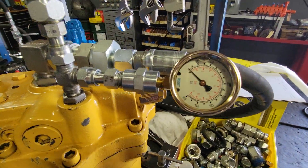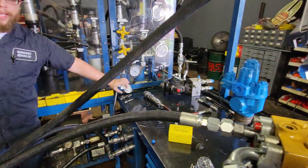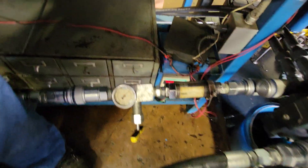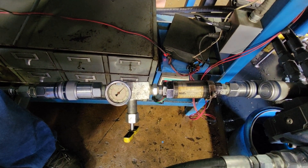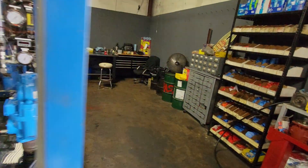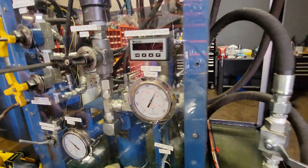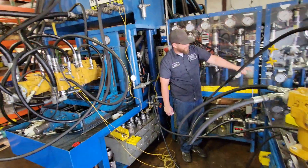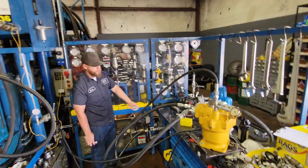We have no PSI there — I've still got the handle pushed in and engaged. Right here I've got about probably one gallon a minute flow, which is just fine. It's not even reading on this gauge. And then here you can see we're relieving at about 4000 PSI. It's going to build back up to 4250.